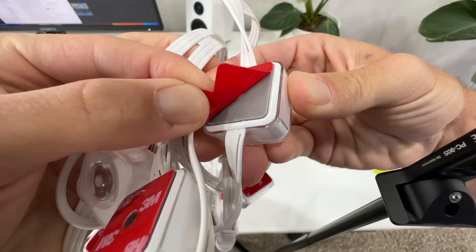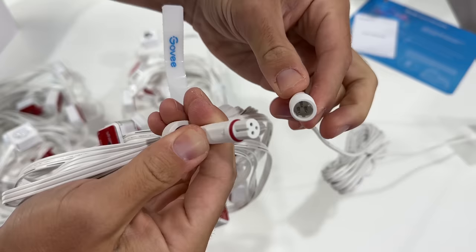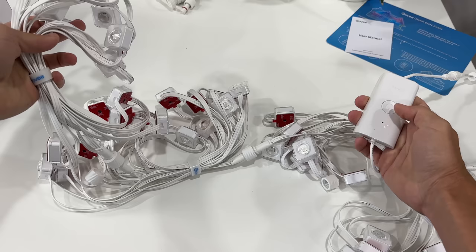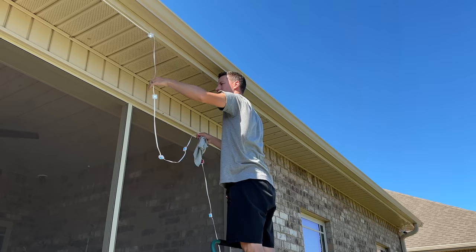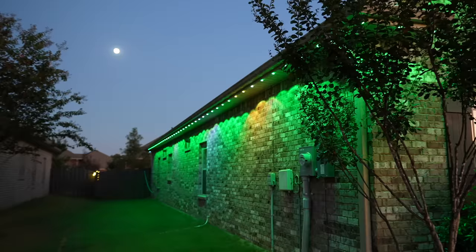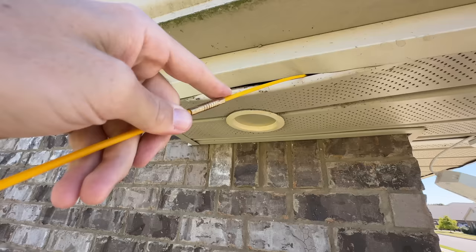Number one, the installation and setup process is really nice. Each LED comes with a 3M VHB adhesive attached. The VHB tape is made for strong bonding and extreme heat and cold — it's the heavy duty stuff. First, test the lights by connecting them together, plug into power and make sure they all work properly. Next, attach them to the soffit or eaves, the overhang on the roof. They recommend about 5 to 10 centimeters away from the wall surface. Even though you could mount them on the fascia or gutter, I don't recommend it, as you want that light casting down to hit the side of your home as well as the ground to create that professional triangle lighting effect.